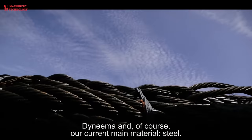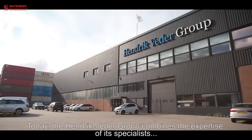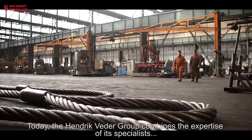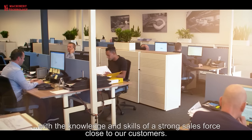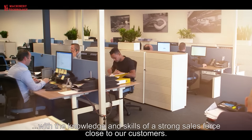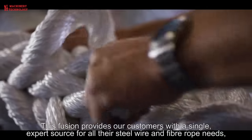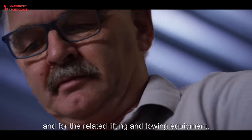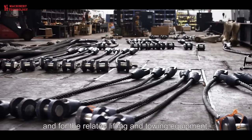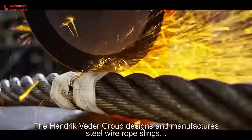Of the wire rope steels, cold-drawn carbon steel wire is most popular, although stainless steel wire rope is sometimes employed as well. Stainless steel rope is most popular for its anti-corrosive properties. Bright wire rope, a type of ungalvanized steel wire rope, is also popular for added strength and durability. Galvanized steel wire rope and galvanized steel cables are a very popular choice. Galvanized aircraft cable, for example, is always a must in aerospace.